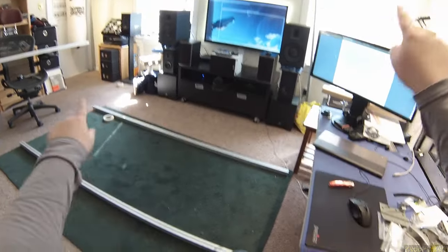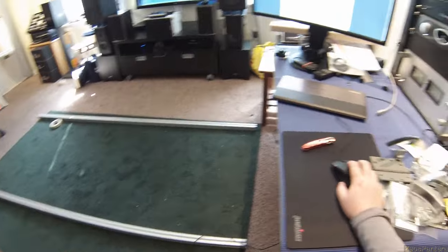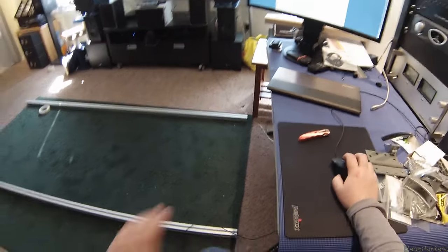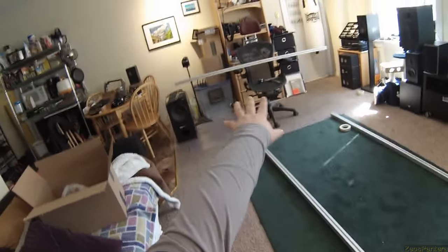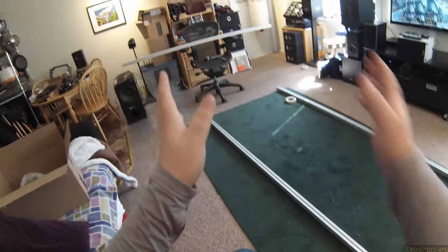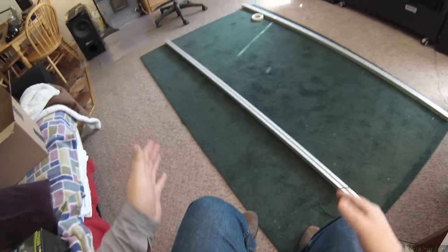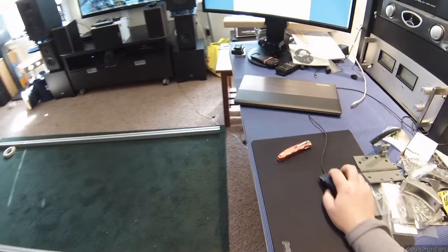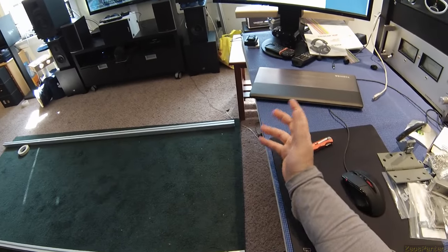So that's how big the screen's going to be. It's going to be diagonally 104.325, and I get to say that exact number. And I did this calculation because I need to figure out the height of the sides, because I have to cut that piece over there. I have to cut two lengths for there and there, and they've got to go between the aluminum that's there. So the height, according to this, is 40.85 inches.